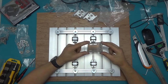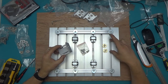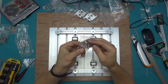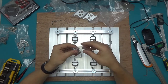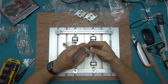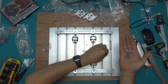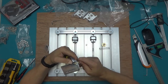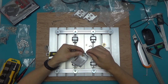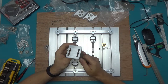What we'll need is the bracket, two parts of the anti-backlash nut, the spring, and the little packet that had the standoffs. One of those standoffs is for this bracket — I think the other is a spare, though maybe we'll use both. The first thing is to mount one part of the nut to the bracket using shorter screws and little nuts going in from this side. There are two standoffs and I'm going to use both of them, because with only one the spring kind of bends — with two support points it will stay straight.